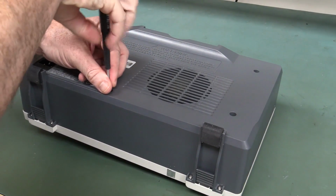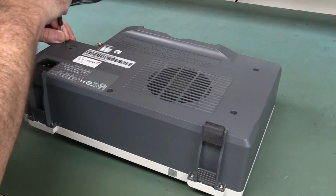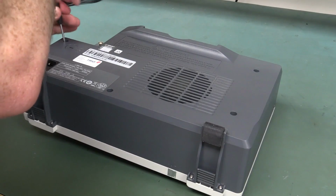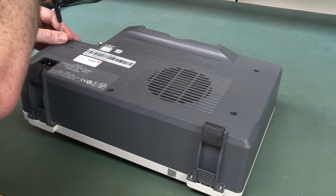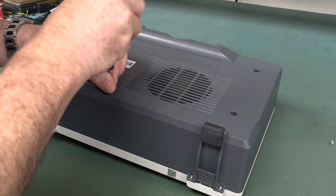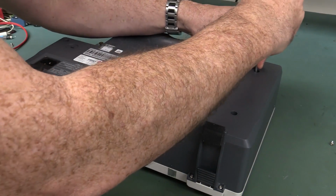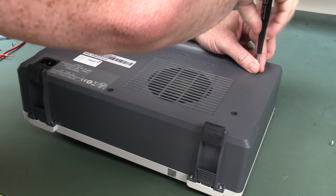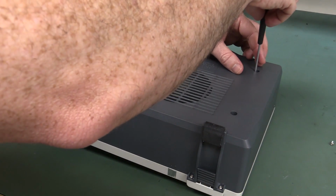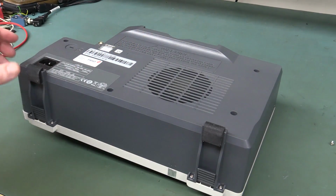Lots of FPGA goodness, I'm sure, because that's how they're going to be getting the 140,000 waveform updates per second, of course. So there's going to be lots of grunt. There will be 2 ADCs in here because I believe the sample rate halves when you put on the dual channel. That indicates that they're sharing an ADC, which is, of course, very common in most scopes. And it should be a different ADC to what we saw in the 1000X because it's a higher sample rate. I don't think they would double the number of ADCs and then interleave them.